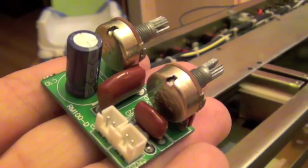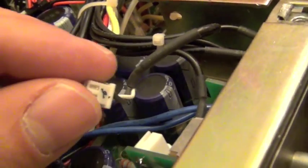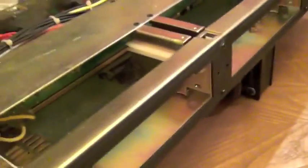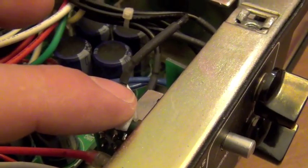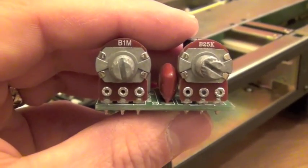By this point you have pulled your connectors and your old presence and density board, and now we have our Salvation upgraded board in here. What you want to make sure you do when you pull these connectors — you can't really see the writing very well — but you want to write with a very fine-point permanent marker. This one only has two connectors so it's pretty easy; the RM50 has seven, so you've got to be pretty careful with that.